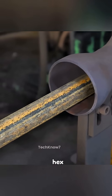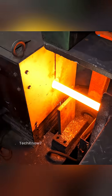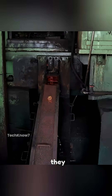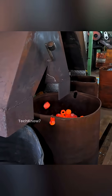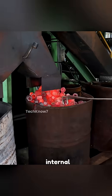Now let's look at how hex nuts are made. Raw steel bars arrive and are transported to the forging line. They're heated to 1200 degrees Celsius and cut to size. The cut billets are then transferred to a forging press, where they are compressed and shaped into their characteristic hexagonal outer profile with a central pilot hole, defining both the shape and initial alignment for the internal threading.